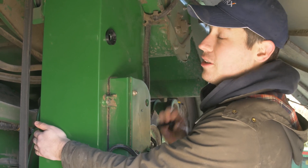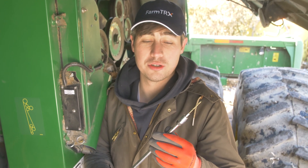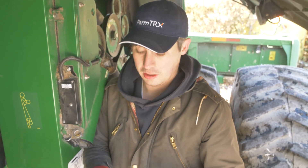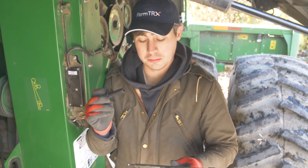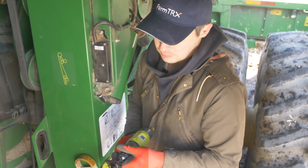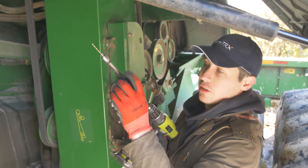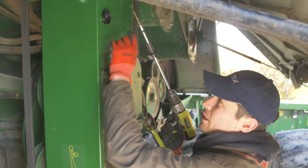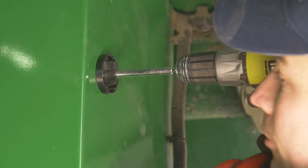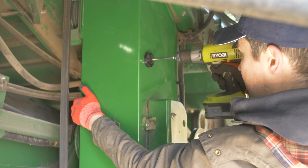First, we're going to drill the hole in the backside from here. Included in the kit is an extension for your drill so that we can drill the backside of the elevator from here — so we don't need to drill blindly. Using that same drilling jig we used to align the first mounting plate, place it on the extension, slide it up, and mount the extension on your drill. Once you're ready and in place, mount this drilling alignment jig back in the mounting plate. Put the drilling alignment piece back into the mount and lock it into place. You should now have a nice straight shot to the back of the elevator wall — drill the pilot hole.